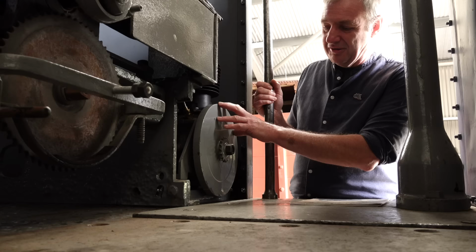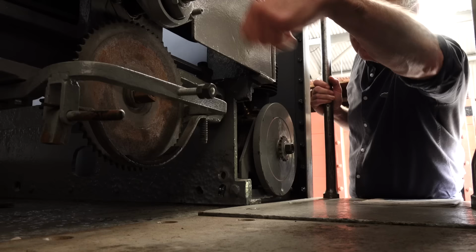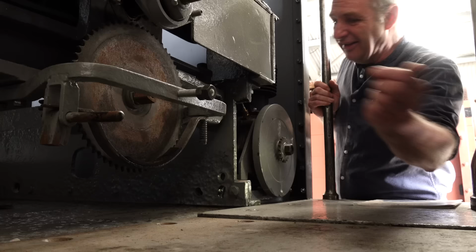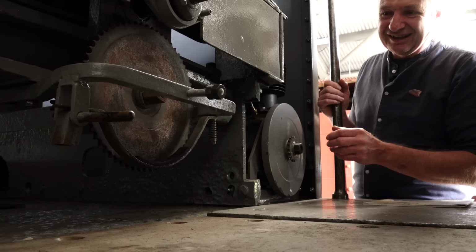And it has a chain drive from here to here. And there's a little gearbox here. If you configure this in the correct way, you can put a starting handle on there, which then drives that wheel to drive that wheel, which will then enable you to start the petrol engine. Once you've done that, you can reconfigure the gearbox so that the petrol engine's turning over, driving backwards through the chain in the opposite direction. And then that's attached to the diesel engine, and according to the book, it's great because a petrol engine will run forever, and even if it takes 10 to 15 minutes to start, eventually it'll start. So a little adventure for the future there. Very interesting and curious arrangement, really.